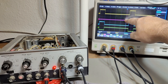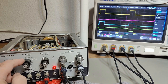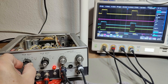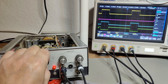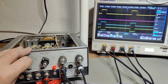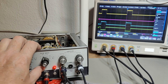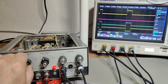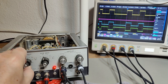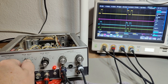The purple track here has a tiny little needle pulse — this is an output reference trigger. And you can see, if I'm poking around with the pulse delay, I can move my pulses from that reference. I can of course change the pulse width like that, and the times 100 — I don't really understand that because it's just not working. I think it has something to do with different modes: single, or — oh, here we go — there's another type of pulse. This is the double pulse mode, and then it is the time between the two pulses. I can make that work. Pretty cool — all in all, I think it works.